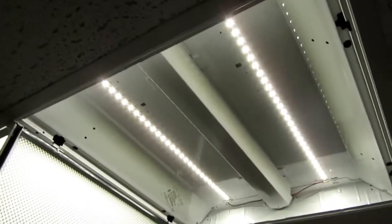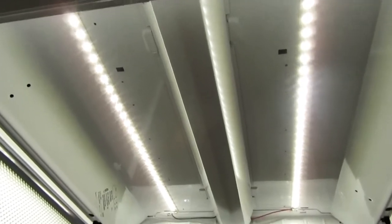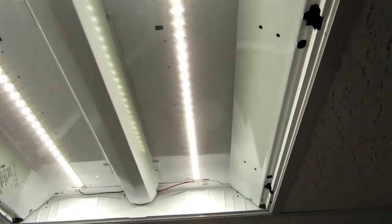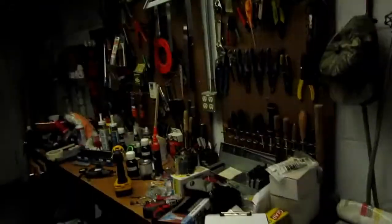Over here I've got this newer style — it's also a 2x2 troffer but it comes already from the factory with LED strips in it in a cool white, and it matches the color of the adjacent fluorescents pretty well. This is a Lithonia brand, which is Home Depot's lighting brand as far as I know. The fixtures are okay but they're a little bit flimsy, and if I don't get the fixture aligned exactly right, the little latches don't want to go in. But by and large it's working out well — I'm getting good light out of these bench areas.